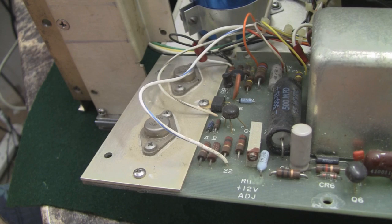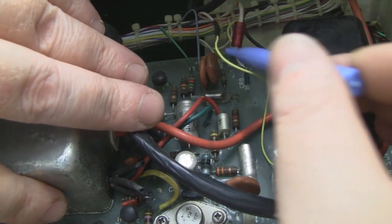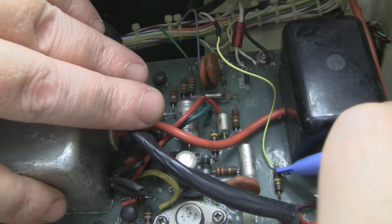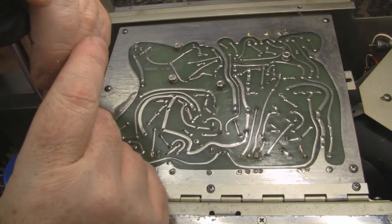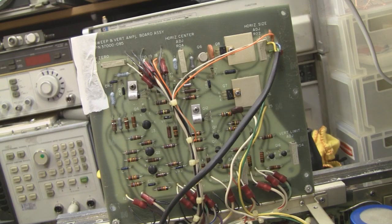The capacitor could be dry inside but there's no evidence of it popping or burning. The resistors look fine, no evidence of burning, and the rest of the wires all seem connected — no more snapped ones. For the two hanging wires, I soldered them directly onto component legs on the underside of the board: one onto the leg of a resistor, and the other bridged directly onto the leg of a diode. The second board also looks okay — no loose wires, no burning or scorching, and all components appear intact.